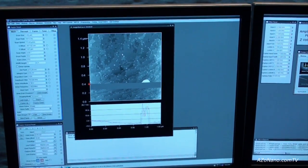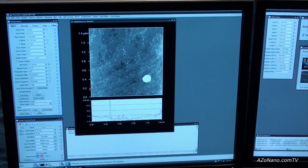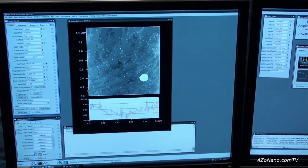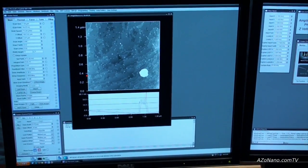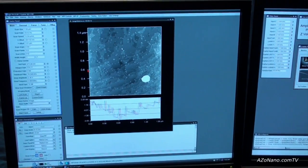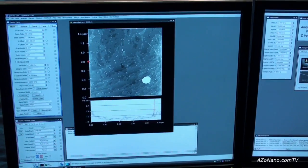What is interesting to note here is that we are able to scan in air in AC mode — this is not contact mode but tapping mode, which is a very nice non-destructive way to image. We can image in this case at around 20 lines per second. The reason we are able to do that is because we have these smaller high-frequency cantilevers.